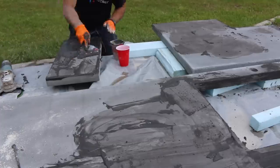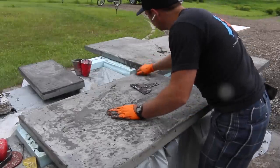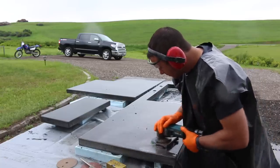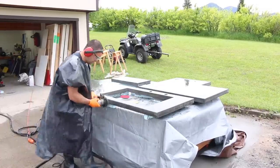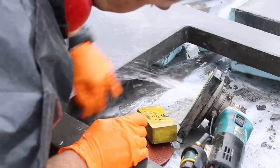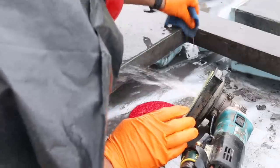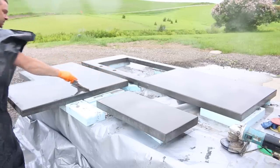The next step is to fill the voids with a slurry mixture. I typically use Portland cement mixed with acrylic fortifier to help it bond a little better than just water. I'll mix in a little color if I'm trying to match the color of the concrete slab, and I'll use my hands to rub the slurry into the holes along with a plastic putty knife to remove the excess. Take your time to remove a lot of the excess so you don't have to polish through a bunch of it later. Once complete, let the slurry dry for at least a few hours, then do the final polishing. I used a 1500 grit pad to remove the slurry and give the concrete a nice sheen. To polish the sink area I'll use a normal polishing pad where I can and get the corners and hard-to-reach areas with a hand polishing pad or a blue scotch pad — I've found the blue scotch pad works really well. After polishing I'll remove the water with a squeegee to check for any spots I may have missed.